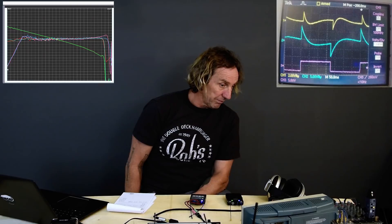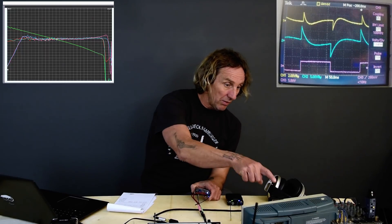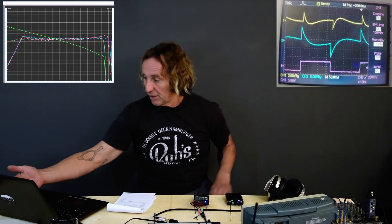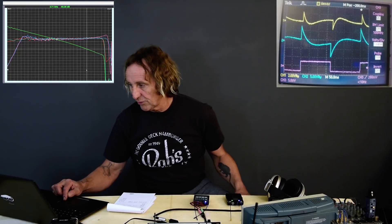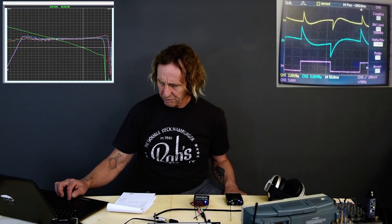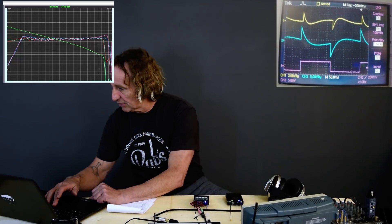As soon as it gets into the little mixing board, it turns into this spiny shape because it can't hold the DC offsets — there's DC blocking in these audio units. It's still showing a sharp spike up, a ramp down not overshooting a lot, and a sharp spike down coming back up. What we're seeing with the Duet is the blue signal going into it looks almost exactly like the yellow signal coming out — great stuff. On Smart, we have a smooth falling line and roll off in the high frequencies. I find the pulse very useful because that's kind of how music looks on analyzers when mixing live, and the pulse is very dynamic versus pink noise, which brings out differences in the units.